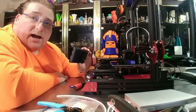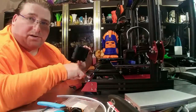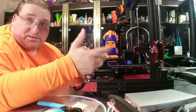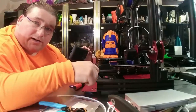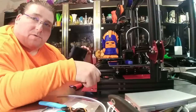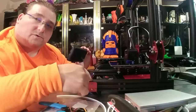It is done. I went through the leveling process — basically you tell it to auto home, then adjust your Z level down until the nozzle is at zero zero. Then you go to the four points, bring the bed up until it's about the right distance from the nozzle — essentially you're setting your Z offset — and then store that in the settings. The instructions are pretty clear on how to do that; it's very easy. After that it does a nine-point check on your bed and gets your mesh. It printed first time no problem. I've got a spool holder sliced for this because they didn't include one.